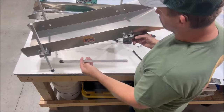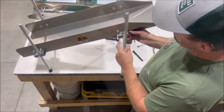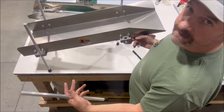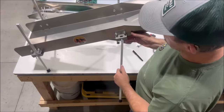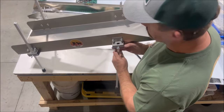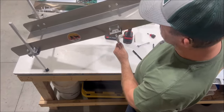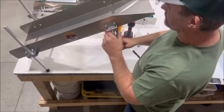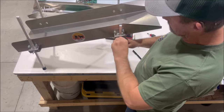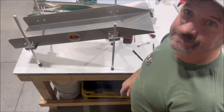There you have it — a quick and easy installation of the 18-inch leg kit. The biggest thing is going off of the front side, going up three to four inches from the bottom, depending on how long your sluice is. Make sure the bracket is right up underneath the bottom, lay it flat when drilling, drill those couple of holes, and boom — you've got it. If you guys have any more questions, that's the simplicity of the 18-inch leg kit. Simple as that.